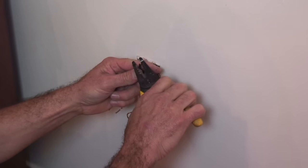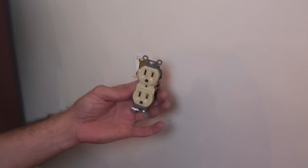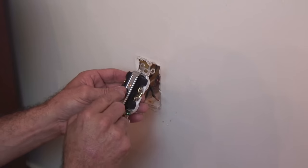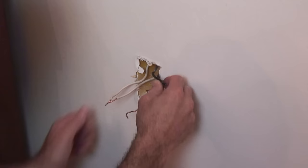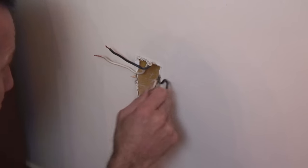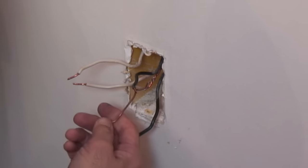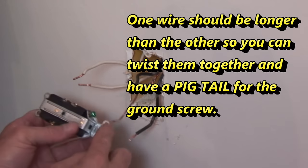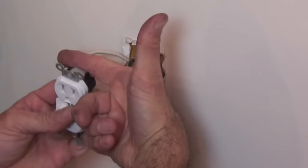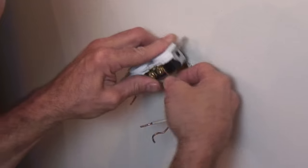While we're at it, Blake is going to be changing out the other outlets because I want to go back with the white ones to match my wall. My other outlets were bone, so Blake's going to swap them out while I fix this burned one. We're going to use this type where I can put the wire right into the clip and tighten it up. These two wires go together — they came from my other outlet. These two wires are on this side of the box; they come in this way, and these two go out this way. There's a pigtail on there where the grounds are joined, but only one wire comes out, so you don't have a giant knot where you're trying to put the screw in. Keep them in order — these two come in, these two go out. You want them in line; you don't want to criss-cross them. It'll still work, but it's not the proper way.